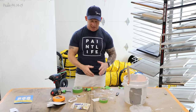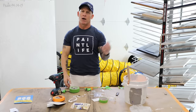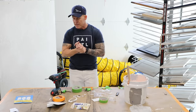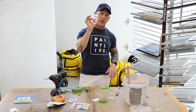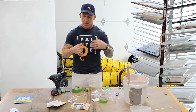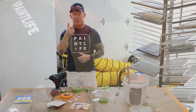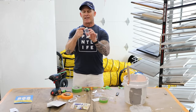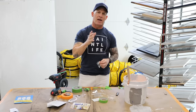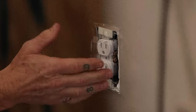I do like how they cover the outlets and the switches — round switches, square switches — they covered them all 100%. The only thing is just pulling off these tabs, but the more I did it the quicker I got. So it didn't annoy me so much. The one question is: are you going to run out to your vehicle and grab a bin full of socket blockers versus just grabbing a roll of tape and doing it the traditional way we've been doing for 18 years? These look a lot more professional than tape. And here's one drawback to tape: if you use production tape on your switches and don't take it off — this is like a three-day release — if you wait four or five days you're going to have adhesive splintering issues on your switch plates. This sticks onto the screws where the outlet or switch screws into the box, and it doesn't leave anything on the outlet or switch itself, so it pulls right off.